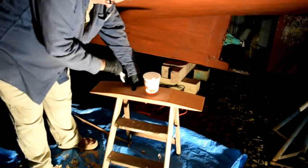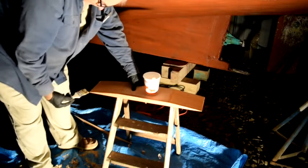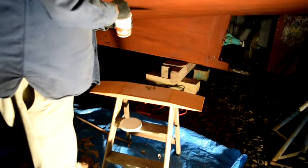So this is pretty simple — put it on there. Now it's really dark on the other side of the boat because it's overcast today, so I don't think I can film over there. What I'm going to do is go paint the epoxy on over there. Now while this epoxy is soaking in, I'm going to thicken the remaining epoxy so once I get it properly thickened to where I want it — so it has some gap-filling properties but is not completely thick — I'm going to use it to set bungs in the wood I installed on this side of the boat over the four permanent fasteners. Let me adjust the camera so you can see what I'm doing up here.